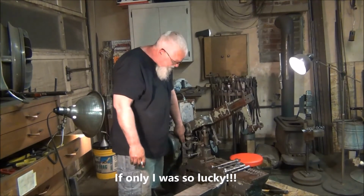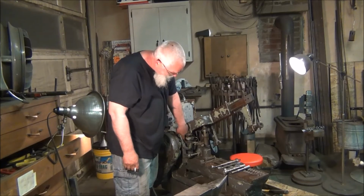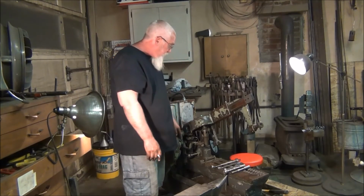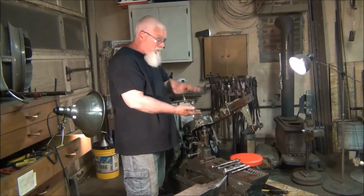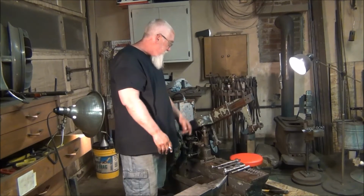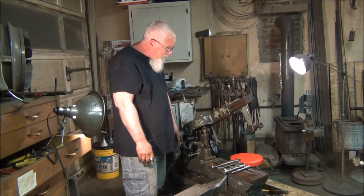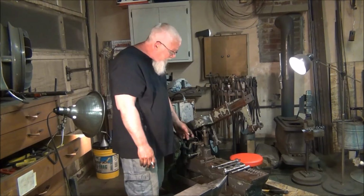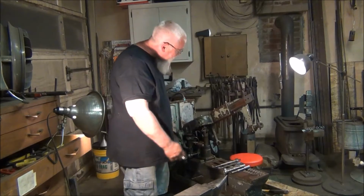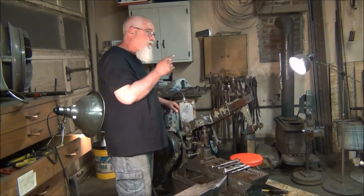So that leaves the pump. The pump is down in the bottom underneath here. There's an eccentric cam right here that I'm sure you can't see. And that pushes down on a plunger onto the pump. And that's what pumps the hydraulic fluid into this unit. And when I had that disconnected, I put my thumb on the copper tube there, and it's pulling a vacuum.